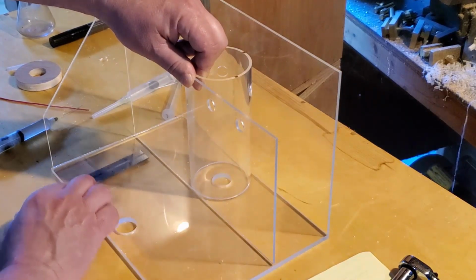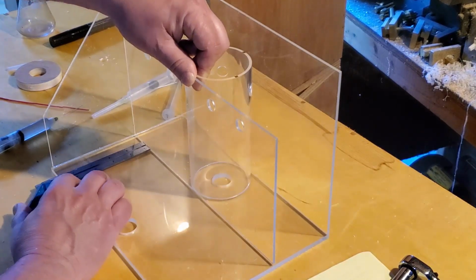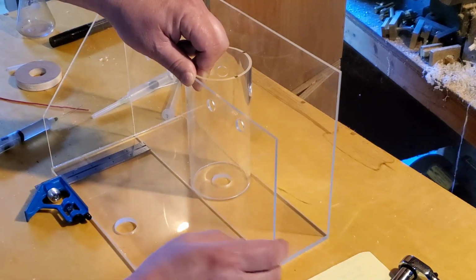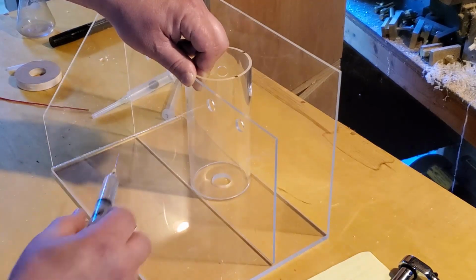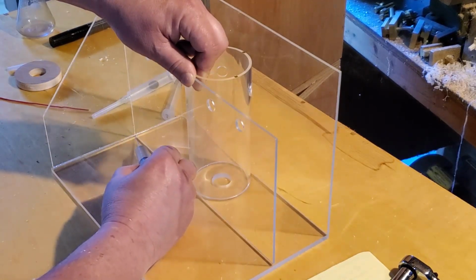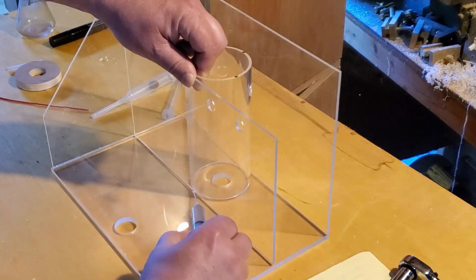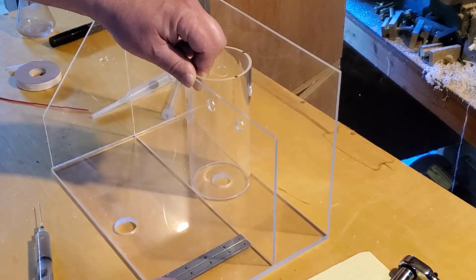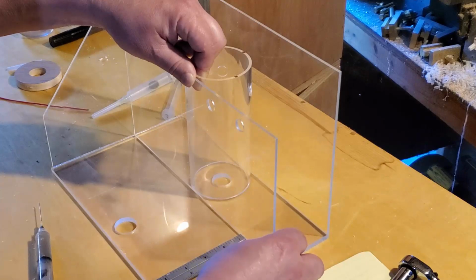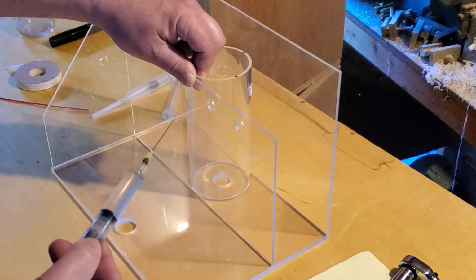But because there's going to be 3 or 4 of these panels right beside each other, you're going to be able to tell if one of them is slightly out of alignment. And I had to take a little bit of extra time here and ensure that these went together, first off, so that they will hold water, and secondly, so that they look like they are where they belong. The first one wasn't as difficult as the others because I have that nice standpipe there to hang on to, and it was quite easy to hold this first off vertical, true as 90 degrees from the bottom, and then I had set the set square here so that I can do the rest of it.